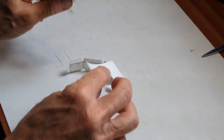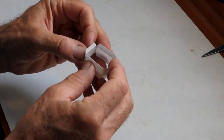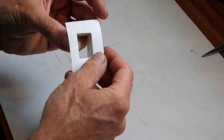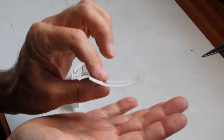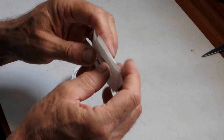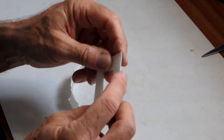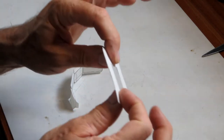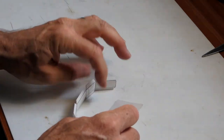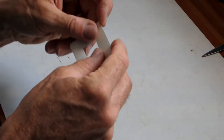Here are those three pieces — a top, a bottom, and the piece that wraps around the middle. It's all looking good and will go together just the same as my paper one. The only problem is that it's a little bit banana-shaped. What I'm planning to do is cut another pair and stick them together so the bends will cancel out and I'll have some nice flat end cheeks. I'm going to need another set of these, and then I can make two bobbins with the ends glued together.